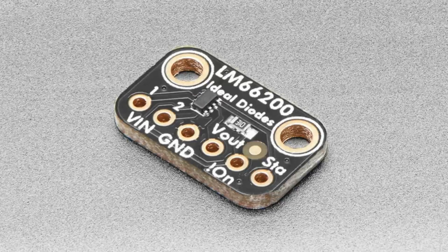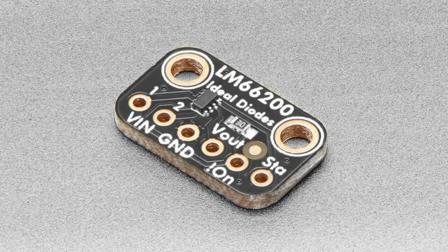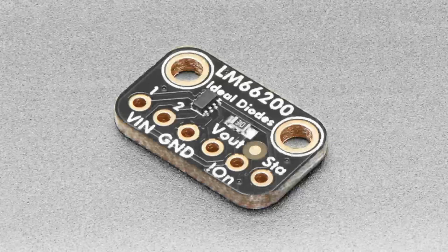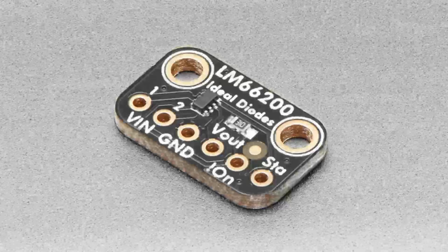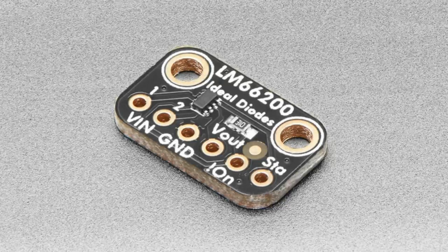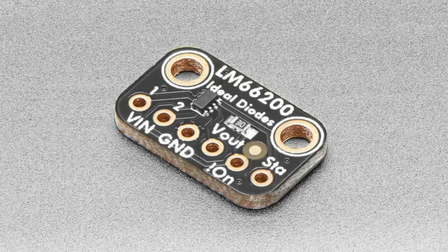Basically, if you have two power supplies on your board, say a LiPoly battery or USB or a DC power jack and USB, and you want your electronics to use whichever is available. Sometimes the battery's plugged in, use that. Sometimes a DC plug is powered in or USB. So decide which power supply to use. You can use two diodes connected as a diode OR, and that will give you whichever is highest, the current and the voltage supplier. But you have to deal with the dropout of that diode, which can be like half a volt. That's a lot of power that you might be losing, especially for low power situations. Also, the diodes are kind of large. Also, you don't have an enable switch, which you can do with another transistor. And then maybe you want to know which one is the one that's activated. So this combines about 7 transistor and diode components into one.